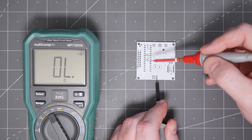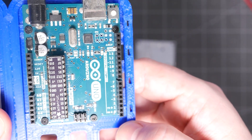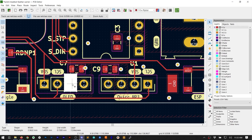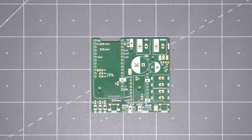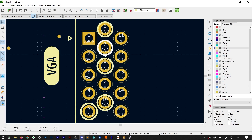Here's a common problem. When you go to debug a board, you find the signal you want to look at, and then you need ground — but where is ground? While looking at a genuine Arduino Uno, I noticed that they marked the ground pins with a white stripe, so I have adopted the same idea. I put a large rectangle on the silkscreen layer that covers the ground connection. On headers, make sure you extend it beyond the footprint's courtyard. I think you could agree it is very clear where the ground pins are located. Another option is to just add an extra circle or square around the appropriate pins — just make sure you put them on both sides for through holes. This one tip alone can significantly improve the debugability of a board.